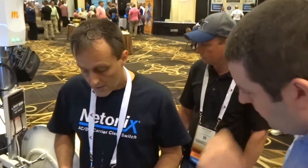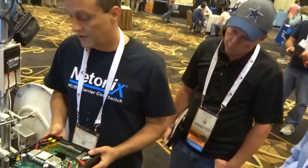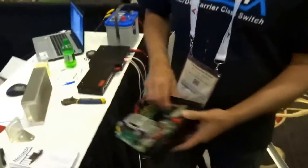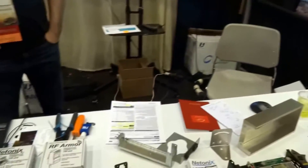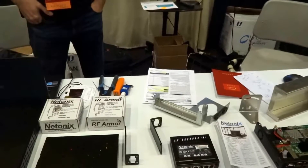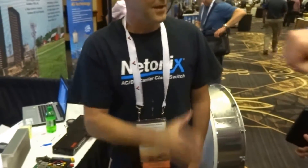That is pretty savage. What sort of money is that? This is $379. It allows you — you don't have to do any type of voltage regulation. Hook it directly to your battery banks and it regulates voltage. Under worst case conditions, this power supply only has 400 millivolts of ripple, compared to the typical 600 millivolts average. Think of ripple for electronics as vibration — that hammering ripple causes components to generate more heat. How do you get the time to do all this? Small company — just three of us. We've just worked a lot of hours. Really exciting stuff — wish you all the best for the future. Thanks very much.